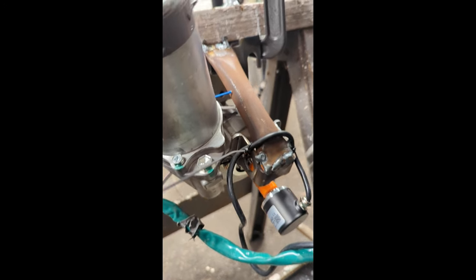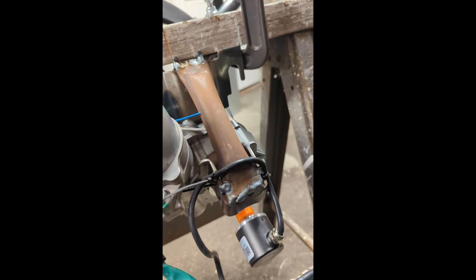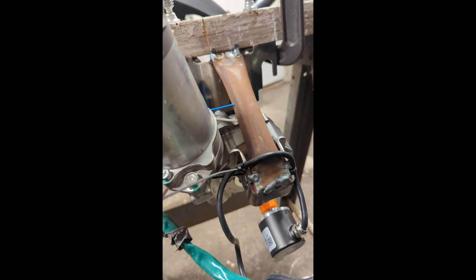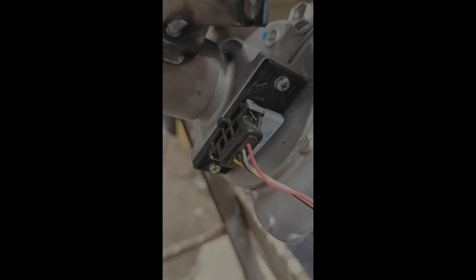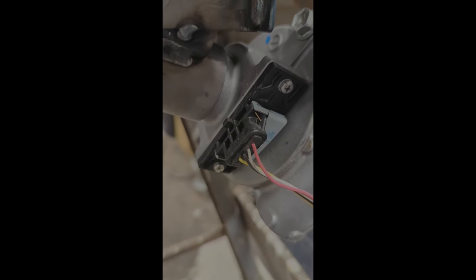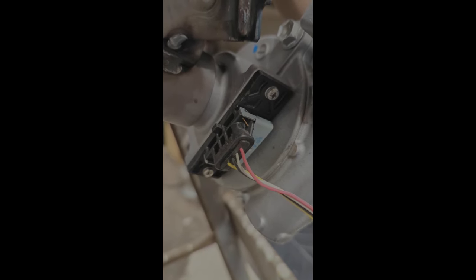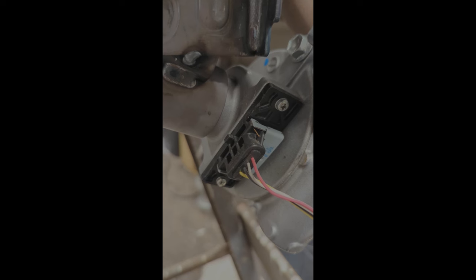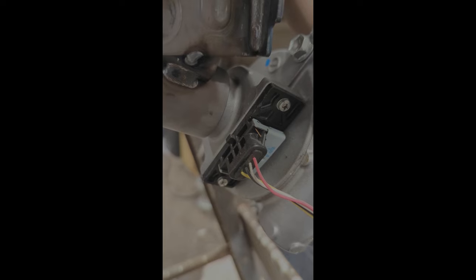This is the stock power steering motor. Now, this stuff here is obviously not the stock power steering anything — I got in there with a welder. I'm sorry to everybody who has to see this, but that is what it is and it's fine. Interestingly, there's this little 5-volt torque sensor. Don't give it 12 volts — give it 5 volts over the black and red wire, and then the yellow and white wire are opposing torque signals. There's no way to force-feedback this into OpenFFB; you could go in through one of the analog inputs, but you'd have to voltage divide it. It's there if you wanted to do something fancy with it.